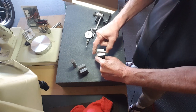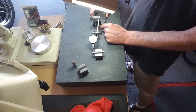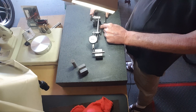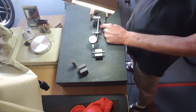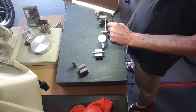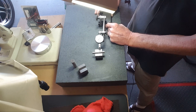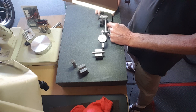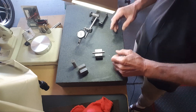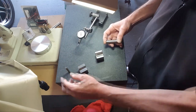The gauge pin is in there, wiped off. Two tenths, getting even higher - almost three tenths. What's this side? I should have mic'd this gauge pin but I'm trusting the pin. This is real bad - look at this. This one's pathetic. I should mark that. Try a bigger gauge pin and see how bad or good it is.